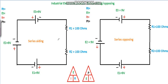If you have negative-positive, negative-positive, negative-positive, those all add together. So I would have 9 plus 9 plus 9, giving me a total voltage of 27 volts in this particular scenario.